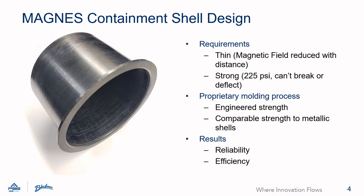It also can't deform and make contact with the moving coupling. Many designs utilize exotic materials like Hastelloy that can be formed into thin-walled strong parts and have somewhat lower conductivity. These parts are typically expensive and still generate some eddy currents.